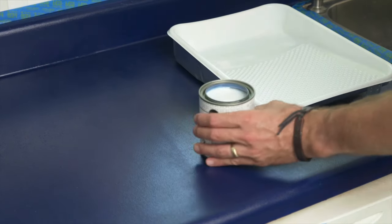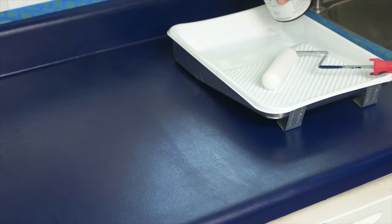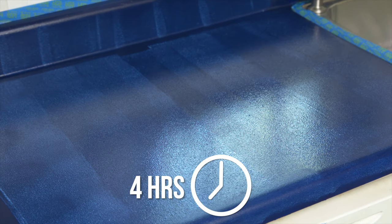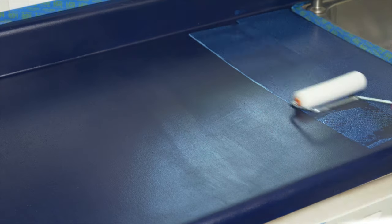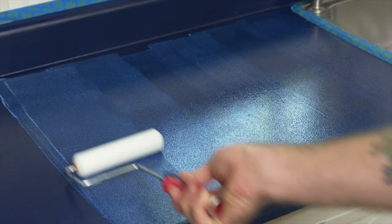Then apply a second coat using the same technique. Once the final coat of paint has dried, you will want to apply a final high-gloss top coat to give your counter a bit of shine and protection. Use a water-based acrylic top coat intended for use on countertops. Roll on the top coat using the previous technique, keeping a wet edge. Once the entire surface is coated and has dried for four hours, you should apply a second coat. Two applications of top coat should be sufficient to create a beautiful and protected countertop surface.